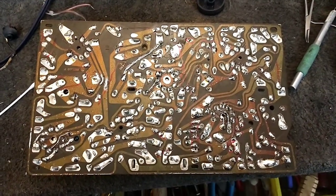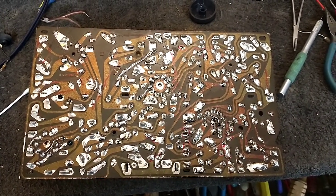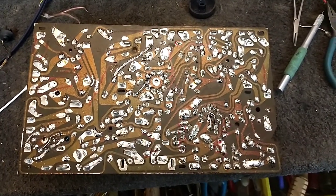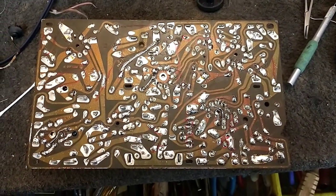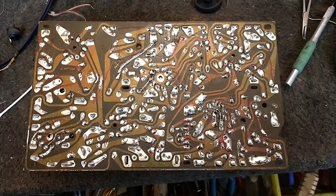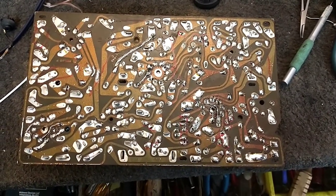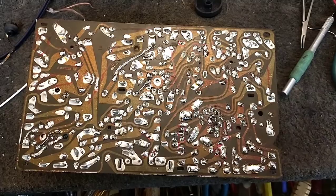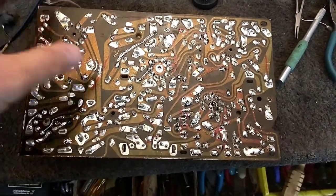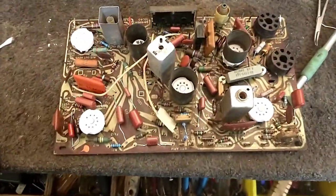And then hopefully the next video, we'll have this wired up to the chassis, and we'll turn it on and hopefully get a full deflection raster out of it, because at that point, then we can tackle the IF strip and the tuner and everything else about it. But I like to work backwards on these sets. You get the high voltage and sweep going first, and then you work on the audio, video, IF, and tuner. That's really the only practical way to do these, just because of the way they're built and whatnot.